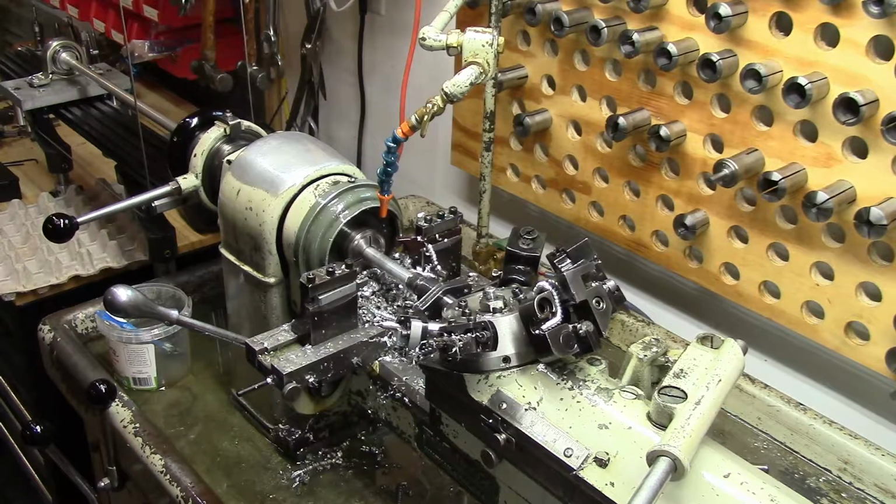And as you can see, this is a very old lathe. It's 70 years old, and it was used extensively over those 70 years, and it is still in operation and highly accurate. I can turn parts on this lathe to a concentricity, meaning a perfect roundness, of 0.0002. So that's 2/10,000ths of an inch. That is almost imperceptible when it comes to measurement.